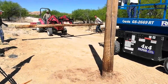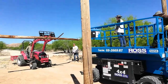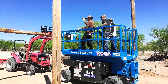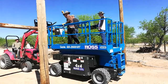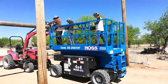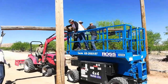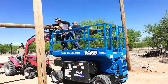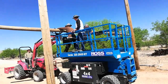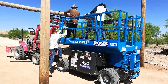As you can see, our hand signal communications also got a little bit better with practice. So the next time we need to move a gate — which hopefully will be never — we'll be pros at it. Now that the post has been set, we are backfilling the hole using our soil fortified with clay and a little bit of Portland cement, wetting it down with the hose and tamping it with a sledgehammer. This will give it a very secure footing and should not give us any problems in the future.